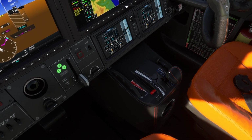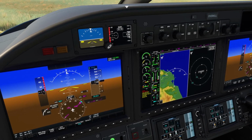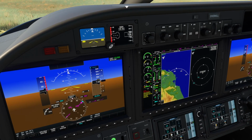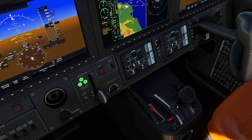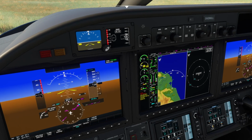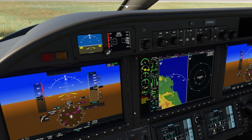50% going to high idle. And here's where the temps will rise dramatically. Starter annunciator is clear. Temperatures are stabilized. Moving the throttle over the gate. There we go. So now we are down into flight idle. Good engine start.